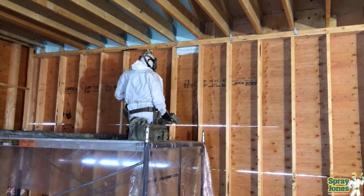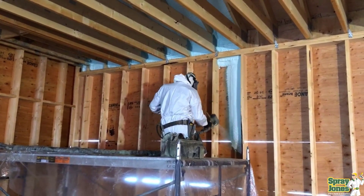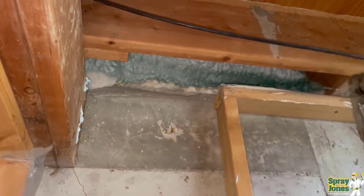I'm far more worried about moisture when putting foam on — wet walls, wet wood, wet seams, moisture inside a seam you can't see — compromising adhesion, than I am about guys putting foam on too thick too quick. Open cell foam we use exclusively in very tight blind corners where we know we'll have to pump in a huge amount of material. If we've got a joist that keeps going back and back, we have no choice — we pump it full of open cell foam. We had a cantilever on a building that was beyond two feet deep with piping and ducting — no way to reach into it — so we used the jet stream to pump open cell foam all the way to the back until it came inside the building. Once we'd achieved that, we switched to closed cell foam and capped the half-pound with two-pound. It's a very good way to go.